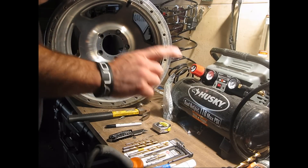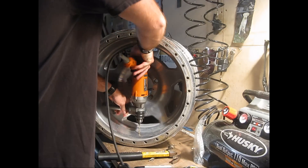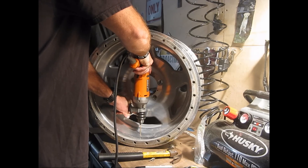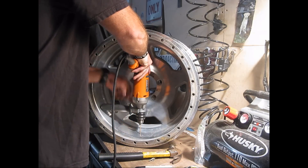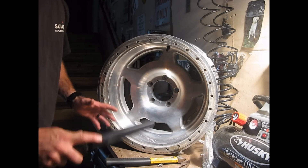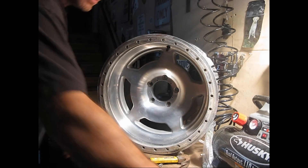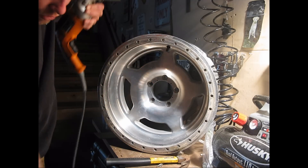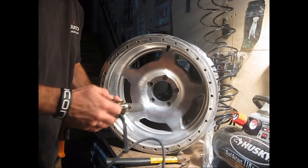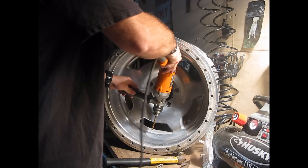The punch is going to help me get started with the drill. Make sure everything is all flat and hold your drill as flat and level as possible. I always like to have a vacuum ready so I can vacuum up all the little shrapnel — if you don't vacuum it up right away it gets everywhere. Then we're going to switch out the bit. I step up four times altogether, so I take the small one out and put the next size up. Once that next drill bit's in, you just find your hole and do the same thing again.